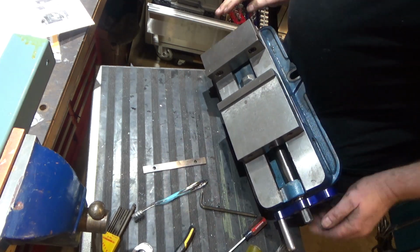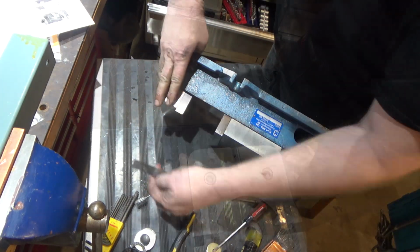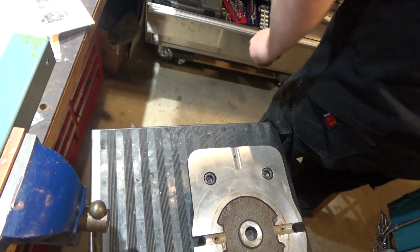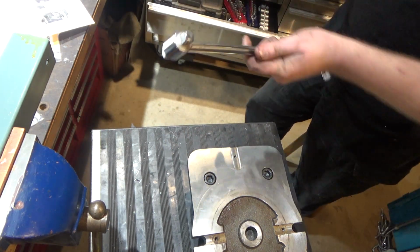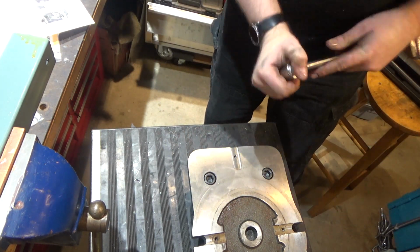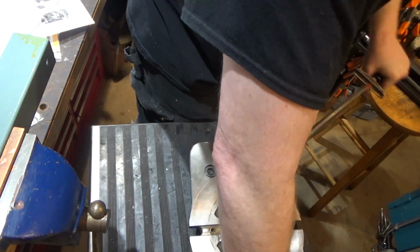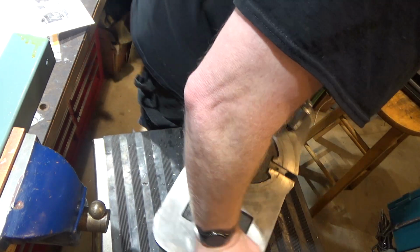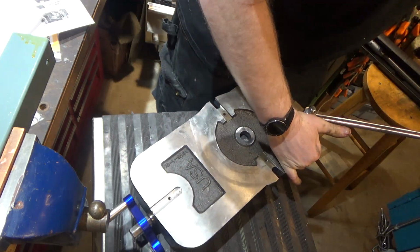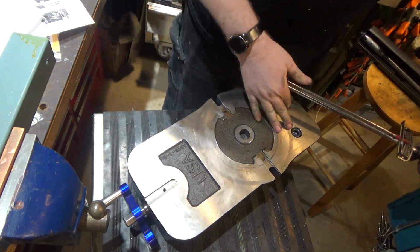So before I do anything, it says to tighten the bolts to 5 foot-pounds before I use the parallel. So what you're about to see here in a second is me actually struggling to loosen these bolts first, because I need to get them to 5 foot-pounds. The reason I'm loosening is because I tried to tighten with a Harbor Freight torque wrench that was really inexpensive and worked about as well. So I'm loosening them so that I can actually set them to the 5 foot-pounds recommended.